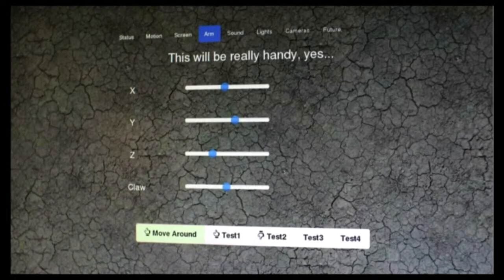The whole thing has a web interface. I initially wanted to go straight to autonomous, but I discovered that teleoperation first is far better than just assuming you can do autonomous. If you have mapping but no way to log in and stop it, it's very inconvenient — you're having to pick up a 15-kilogram robot and say 'don't go out that door' or 'there's a person there, please don't run into mum.' It's kind of handy not to run into people.